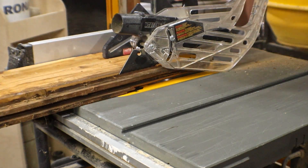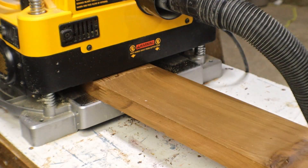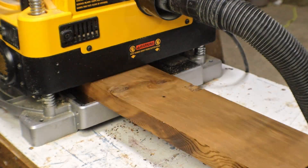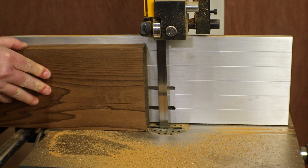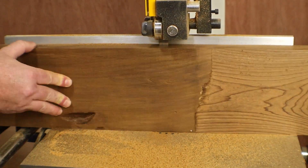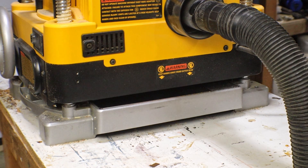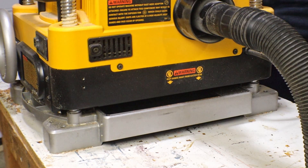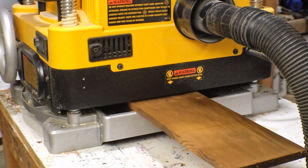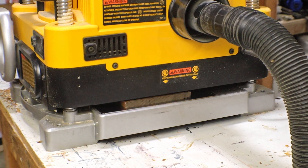Once I'm sure there are no nails, I can trim off the tongue and the groove, and then take it over to the planer — I'm just going to clean up the surface a little bit. Then resaw it on the bandsaw. After I have these to rough size, they go back into the planer to bring them each to half an inch. These boards, unfortunately, can be filled with a lot of knots, and the planer made a mess of some of them. But I should still have enough wood for this side after I trim away all the knotholes.